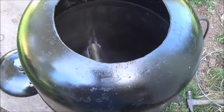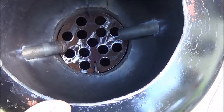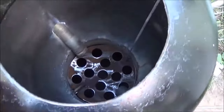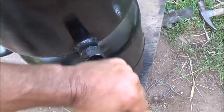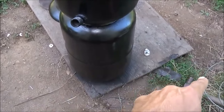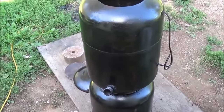That is all you're going to need to do to make this gasifier. Basically all the working pieces are done. The only thing I have left to do is find some way to hold our lid down — some spring latch system — and I'll show you that when I get it done. We can dump the ash, we've got airflow into there. I'll put some plugs in these so you can regulate it. All we have to do at the end is put a hole saw hole in our lower container for a gas out pipe, add some legs, and this gasifier is ready to go.